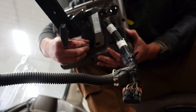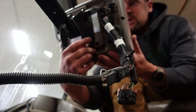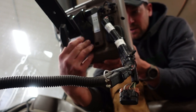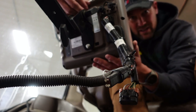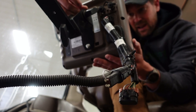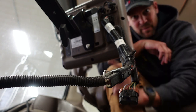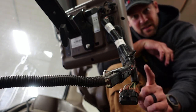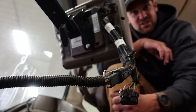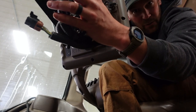In order to have the wireless blockage sensors connected and everything moving correctly, I'm pretty sure we're going to need the computer in here. I've got my RTK monitor here — this is a 2630 John Deere monitor. I think we'll need an iPad in here, which they are bringing. And I'll have to put on the satellite globes both on the tractor and on the implement for the passive implement guidance, which as tillage man Sam has pointed out before is much different than the passive aggressive implement guidance, which just makes vague suggestions to you as far as what you should be doing. That's not actually a thing, by the way.